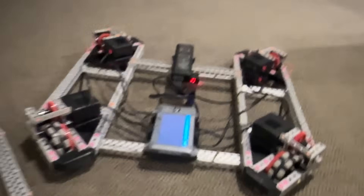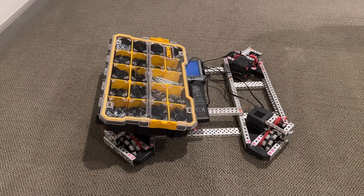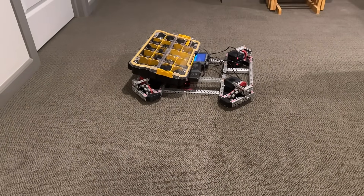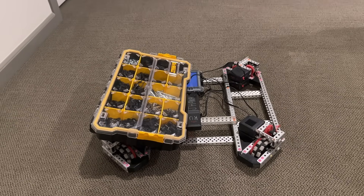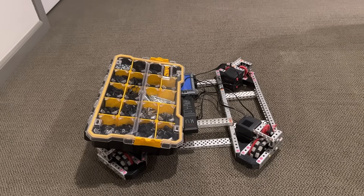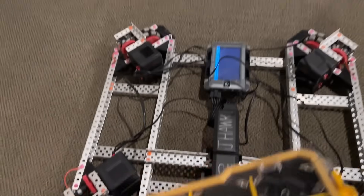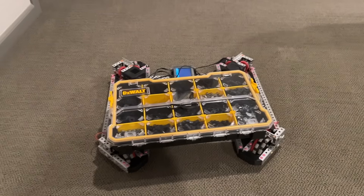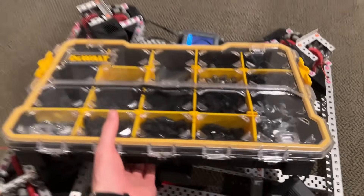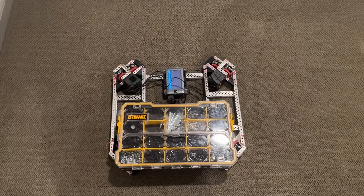But that's also going to lead to some center of gravity issues. As with most standard drive bases, you do want to make sure that the left and right half sides of your robot are balanced. Because as you can see here, when I add a bunch of weight to one side of the robot, it's not going to drive straight. It is probably a little bit more susceptible to uneven weight distribution than a tank drive would be. The other thing important to consider with your X-Drive is your front-back weight balance. This isn't really something teams think about much for a tank drive, as long as you're not going to tip over. You can see forwards-backwards driving is still pretty straight. However, if I go ahead and put this toolbox at the back of the robot, then when I go to strafe, you're going to notice it's not going to go straight.